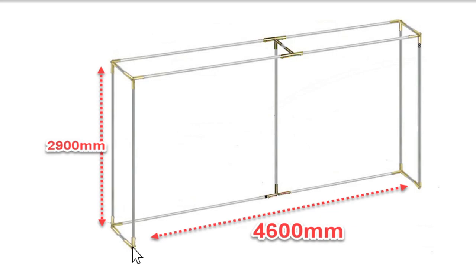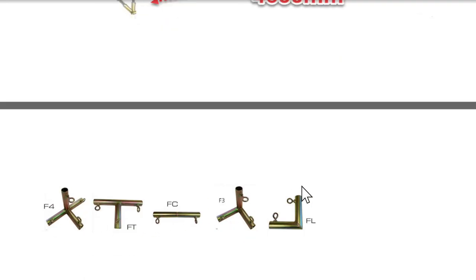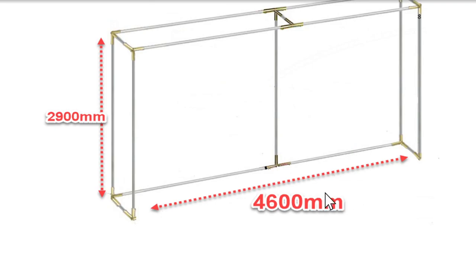I had some corner pieces made out of slightly smaller square tubing, and then the 50mm by 50mm tubing slid over top — the opposite of what you see in the picture. The smaller diameter tubing was the corner pieces and the larger diameter tubing slid over, then I threw a bolt in and bolted them together. So you end up with Y-pieces in the corners, a couple of 90-degree pieces, another Y — basically a package of components. When you draw it out on paper it's pretty easy to understand. That's the only welding I did on these corners. I'm not much of a welder, so I cut out all the pieces, supplied the tubing, and took it down to a friend who has better welding skill. He put them together — I dropped them off at the start of the work week and picked them up on the weekend.